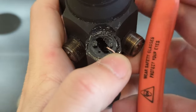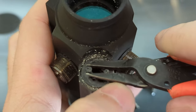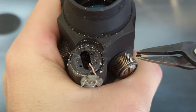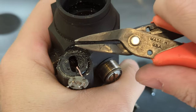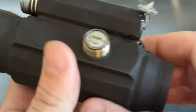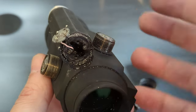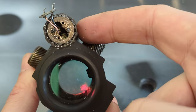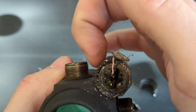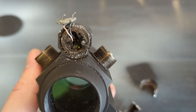Let's see what we tear up with the pliers. Got our made-in-USA little pliers. We're going to get on these two screws and see if we can turn this thing. And... snap. Well, crap. With that frustration — you could heat this, but there's a problem: the whole thing's aluminum which makes the whole damn thing a big heat sink, and I'm more scared of damaging anything inside with heat. So I'm going to hacksaw right through here, split this thing in half, and crack it open off camera.